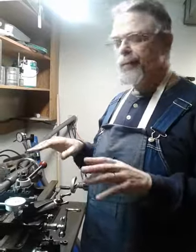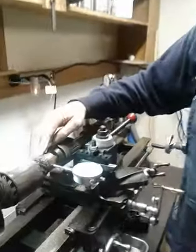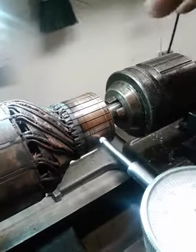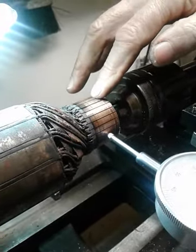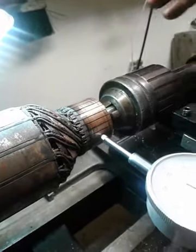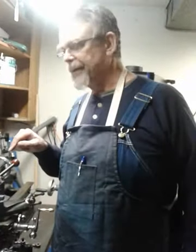That's not too bad. But you can also see the commutator — we showed this earlier — there's a little bit of wear from the old brushes. So what we're going to do next is I'm going to take the dial indicator off, set up a cutting bit, and true the commutator. I'm just going to cut a few thousandths of an inch off to get it nice and true again. We'll pause here while I change the lathe over.